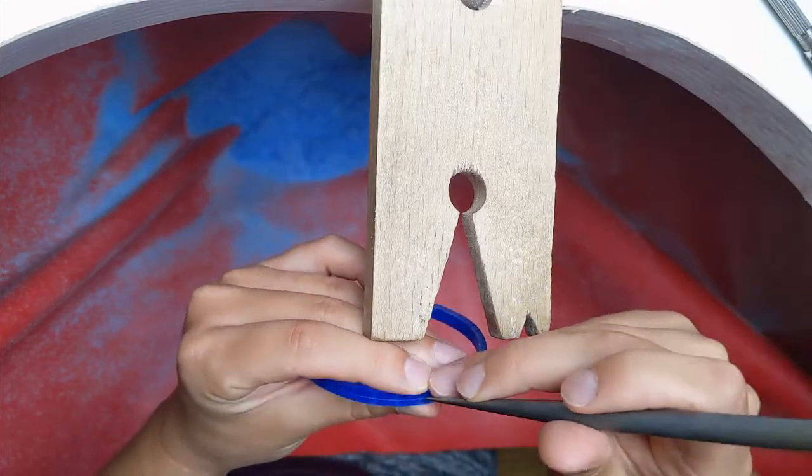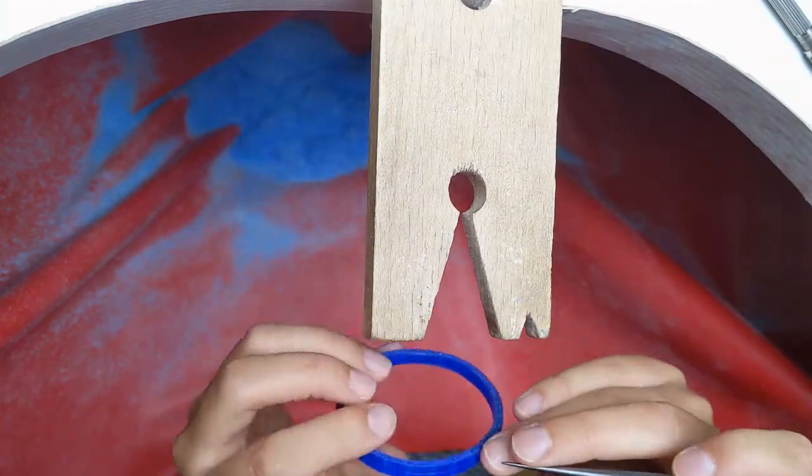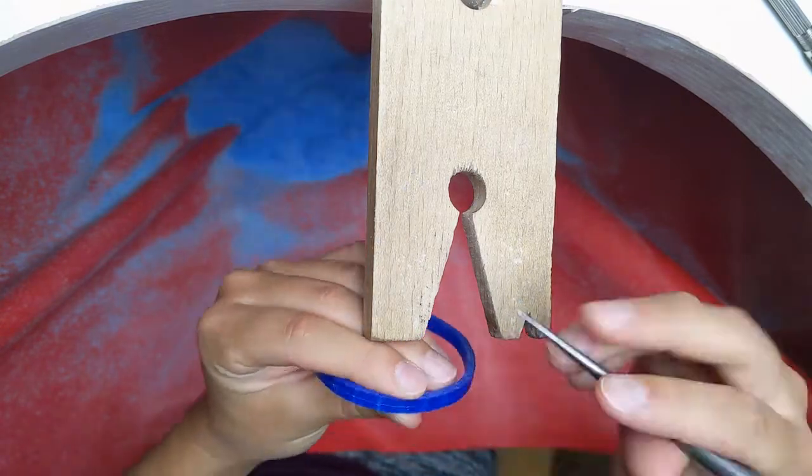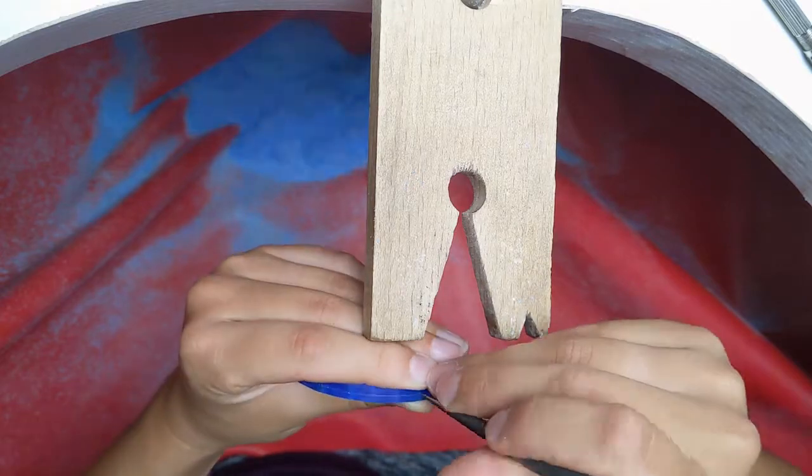I want to drill through the holes I already have from the top. You can clearly see that the wax is lighter blue on the drill holes. So now I just have to mark the center point with a scribe where the lighter wax meets the center line.